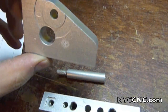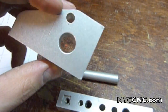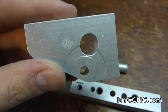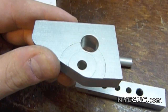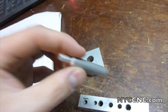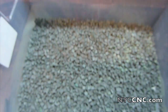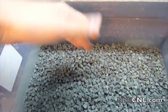Here's how the parts look after the green triangles. They definitely have a nice matte, speckled finish to them. But because I don't have the most rigid CNC mill, the toolpath marks it leaves are a little rougher due to low rigidity, so they're a bit deep and aren't completely gone on this part. This part looks pretty nice — nice matte speckled finish. Good finish overall, but you can still see some tool path marks. That was with the previously bright green, now dusty green triangles from Eastwood.